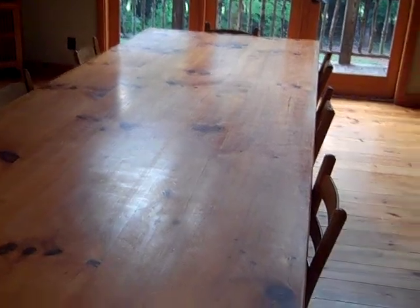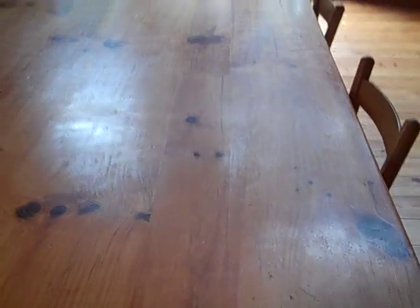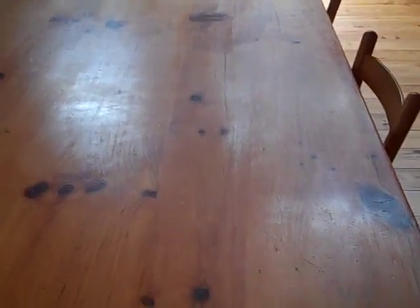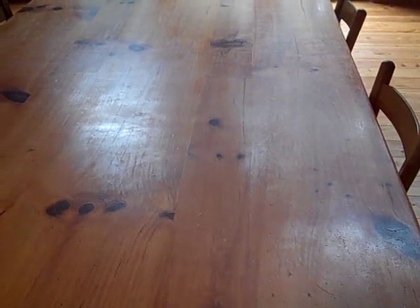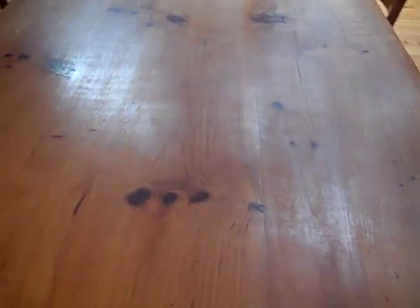The way these are joined — my buddy has a biscuit joiner and we cut slots in the entire length of these boards, except within about 6 inches of the ends. We glued in plywood splines, so it's held together extremely well — glued-together splines. You'd call that spline joinery to hold the table top together.